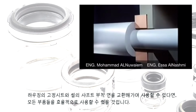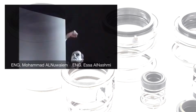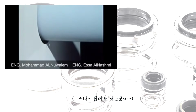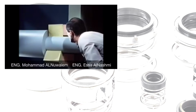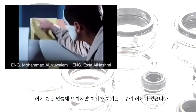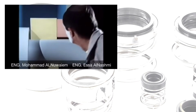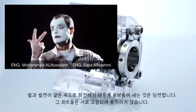A stationary seat at the housing, a seal face on the shaft. Exchangeable wearing parts make it possible to optimize the various available materials. Here, the seal is perfect. But here and here, we still have a leakage path. Of course! Instead of one sealing gap, there are now three. No wonder there's a drip.